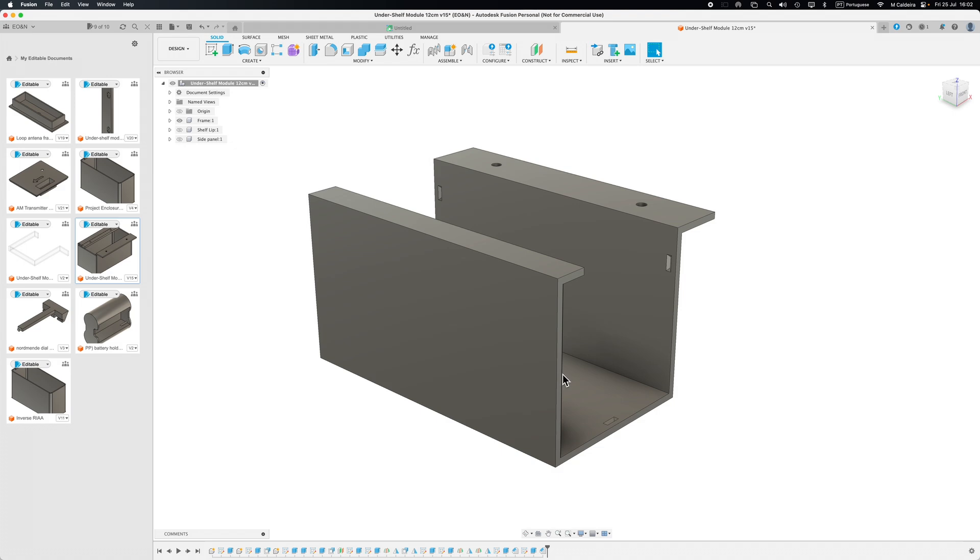I've also made the walls slightly thicker — some of the ones I printed were one and a half millimeters; this is two and a half millimeters. Previously I had printed a faceplate with all the text and holes, but in this iteration I'm not going to use that. I'm going to use a stick-on version that's printed. I design it in a drawing program and print it on self-adhesive sheets — white, glossy sheets for laser printers. It allows me to put color on and all the markings, and it's a lot more refined when it comes to text because the text when 3D printed was not coming out the way I wanted.